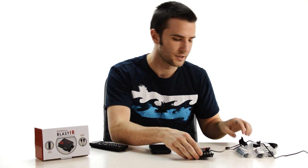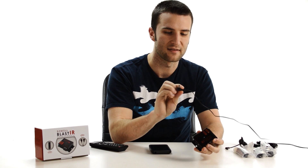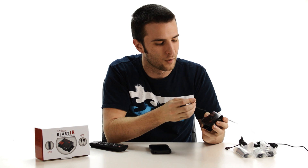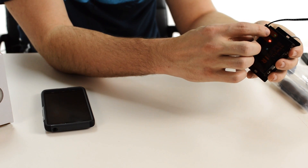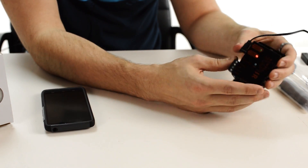For starters, you're going to want to plug the power into the wall, and then this side goes into the port labeled 'Power 12 DC' — not the status port, the green one; that one we're not going to be using. Once you get that plugged in, you'll get a red LED indicating that the power is okay.